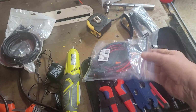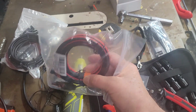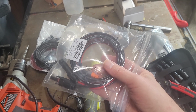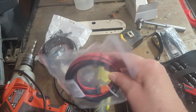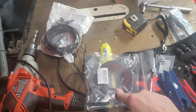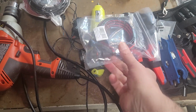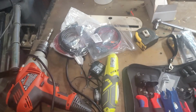Then to the Delta Pro, the solar has its own connector, which they usually sell. Sometimes they sell it with the Delta Pro, sometimes they sell it with their own Ecoflow solar panels. But you might have to go online and find one. This is an XT60i connector that plugs directly into the back of the Delta Pro in the solar input, and it's got an MC4 on the other side, so you can run that out to your solar panel and an extension.